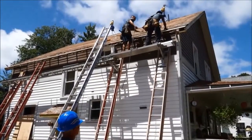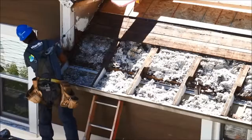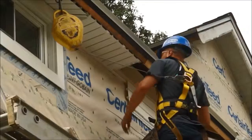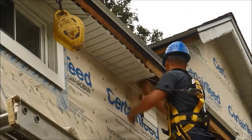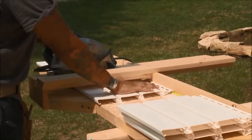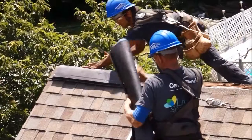The area we're working on is the eave and the soffit area, which was dense packed with insulation that prevented proper airflow. We're installing baffles to make sure the airflow is going to be balanced and correct when the siders come in, which will be filmed installing perforated soffit. The baffles installed at the knee wall go into the attic space, and the airflow will start at the soffit with the perforated soffit and be pulled out through the ridge vent, which we'll install at a later time.